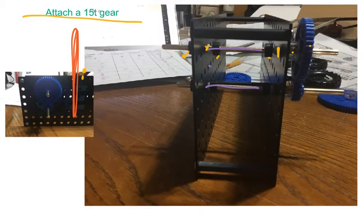All right, so same setup. You're going to put in the axle bushings, which are the white pieces, and you're going to put, let me do green. Let me erase this. Green. So can you see the little white axle bushing? And there's a little white axle bushing right there. I'm going to be sliding that axle in, but when I do, I have to make sure that I have 2 rubber collars on the inside, and there's going to be one out here on the outside. Then I'm going to slide in my drive collar, which will be snapped onto my 15-tooth gear. That's how it looks on the side.